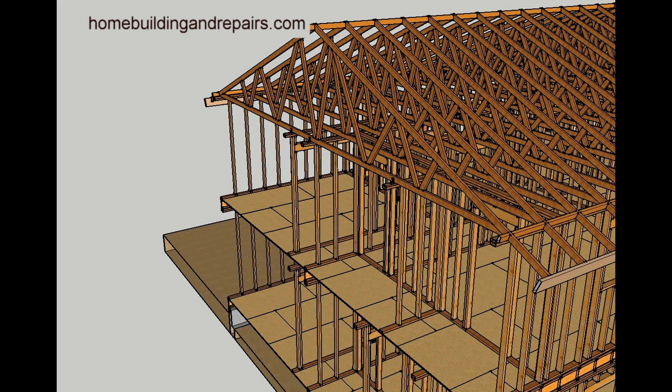This is one of the reasons I'm making this video — someone sent me a question about a damaged ceiling. If your drywall ceiling is damaged it could be from expansion and contraction, but most commonly it will be from somebody adding additional weight to the roof truss system. In this case the individual said someone hung a heavy shelving system in the garage off the trusses, causing damage on the inside of the house.